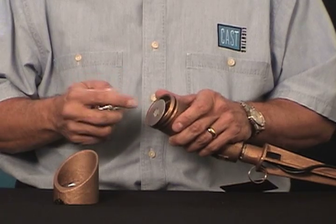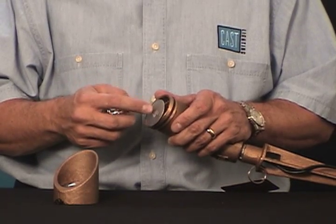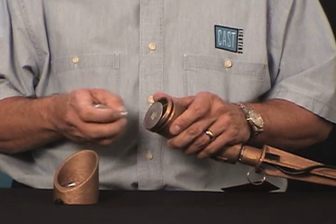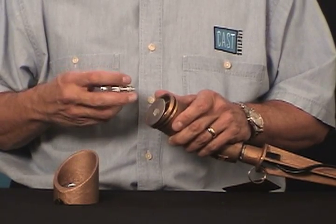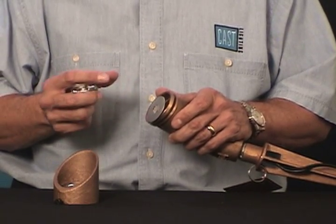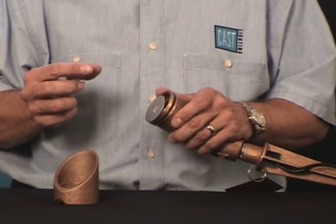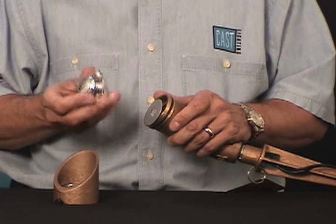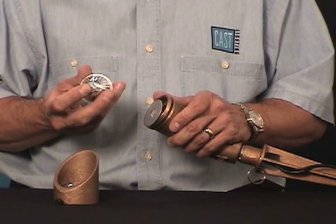In addition, there actually are spring-loaded contacts with a 3/16 stainless steel spring, so that over time, with the heating and the cooling outside, the contacts don't lose their connectivity because the metal fatigues. The spring always ensures we have a beautiful solid contact against these bipins.